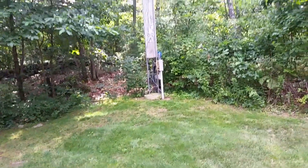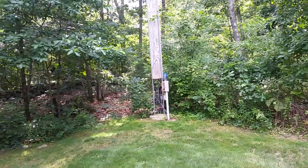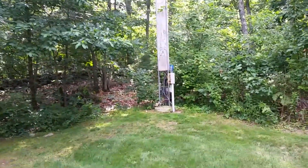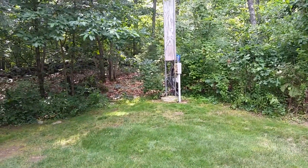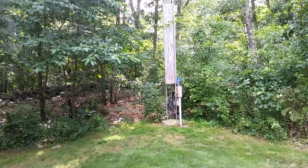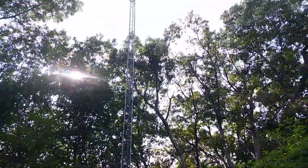In particular, his Starlink was actually at the top and the only device on the tower, which makes it a perfect target for lightning. That's something to think about if you're going to do something like this — lightning protection. The tower being grounded is supposed to keep a bolt of lightning from doing too much damage inside your house, but it does nothing for saving any of your equipment.